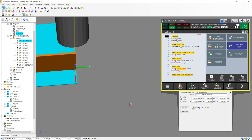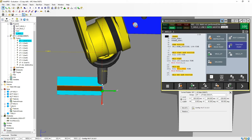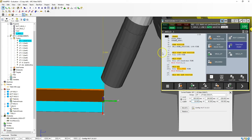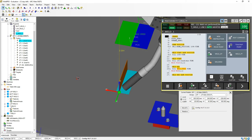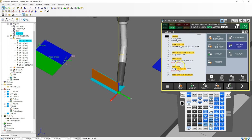Now that I have my position, I need to make that rotation so it's the correct direction. We're going to start from this side and weld to the opposite side — we want to drag. So we're going to utilize the W and make sure we're in the correct direction. I like to go 20 degrees. You can see 20 degrees is going to be a push weld, so I need to add a negative number to that — so that's a drag weld. Now that I have that position exactly where I want it, I can start saving over these previous points. This is going to be my weld start, so I go to number 12 and go shift, touch up.